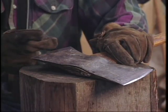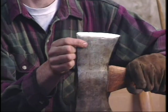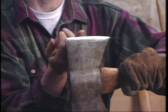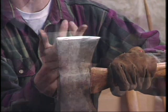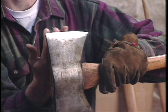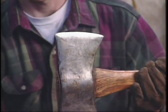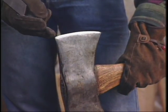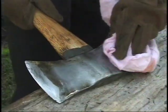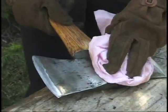Once the wire edge is gone, axes and Pulaski's should be sharp enough to shave with. Test sharpness by touching your fingernail to the edge — if it sinks in with no weight, it's sharp enough. Don't bring your finger down; only expose the fingernail. When filing the chisel edge, file at a much steeper angle to keep that cutting edge thicker, since this is the part used for roots. Once finished, grease the axe and put it in a sheath.